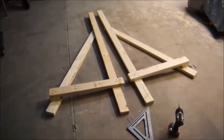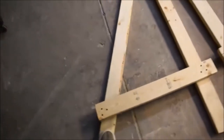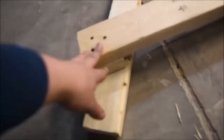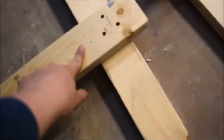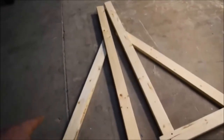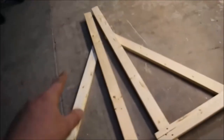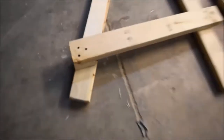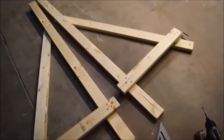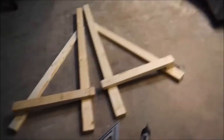Just finished making the two legs. I just want to quickly go over what I just did. The first thing I did was get the kicker out, put the space block on the end, and then I attached that 11 and a half inches from here. This space right here is 1 and 3/4 of an inch. Then I took the back leg, made it flush with this right here, put one screw in the top, and pulled it out until it was with this edge right here. The other leg is just that but mirrored. Now the next thing we have to do is install the front crossmember.